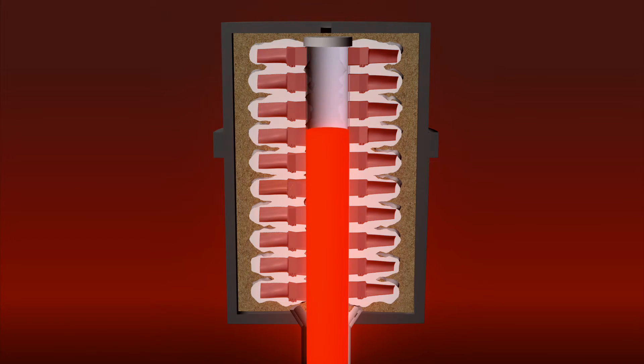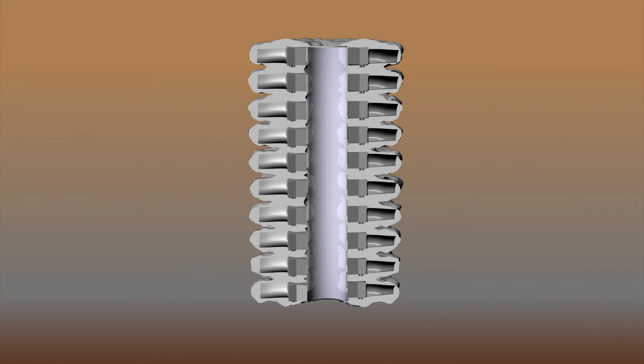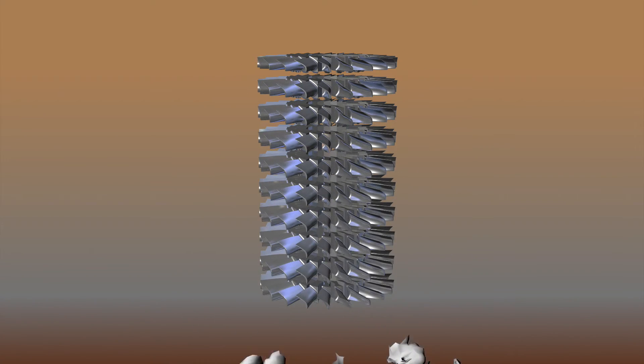The vacuum is released when the parts and a portion of the gates have solidified, allowing the molten metal and the central sprue to return to the melt. After casting, the metal cools and the shells are tumbled, stripping them of the now brittle ceramic coating.